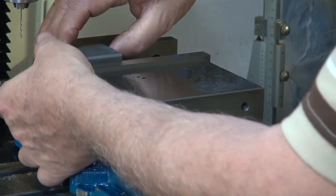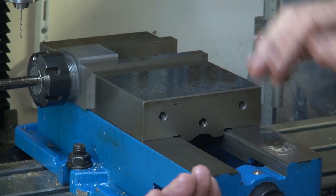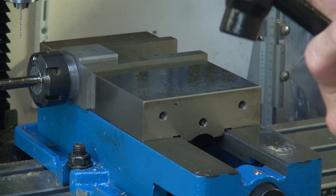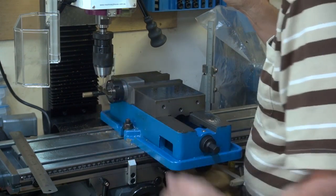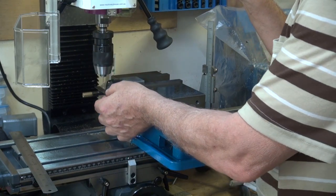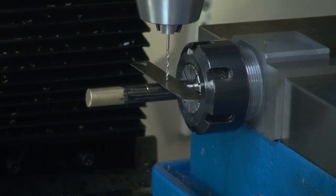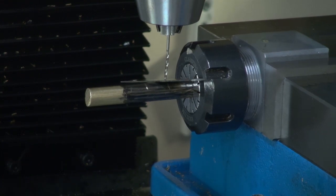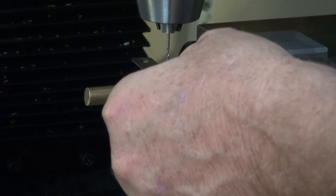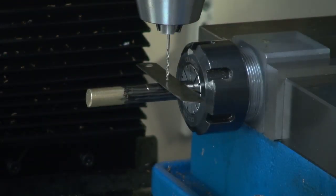Very smooth operation. I'm going to take it up to the edge and touch it up — I'm not going to over-tighten because of that racking. Just give it a little nip. The handle comes off so it doesn't get in the way. As I showed in a previous video, the trick of getting centre — that's a feeler gauge, but you can use a razor blade or a steel rule. If that isn't centred, it's going to tilt one way or the other. You can see that lever's tilted towards the back, which means I've got to move this to the back, and as I go the gauge starts to even out.